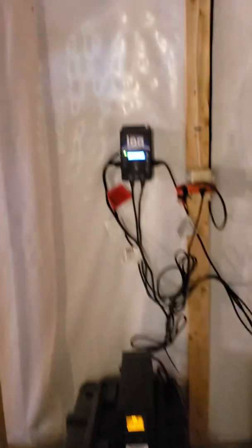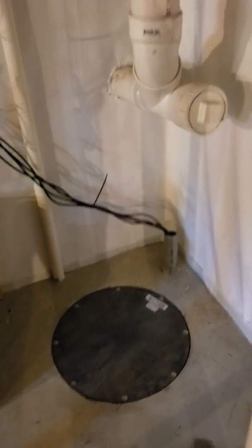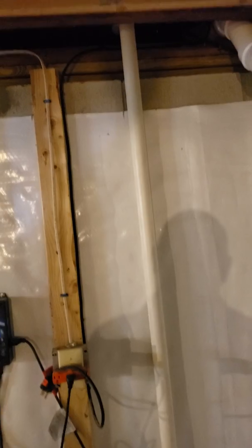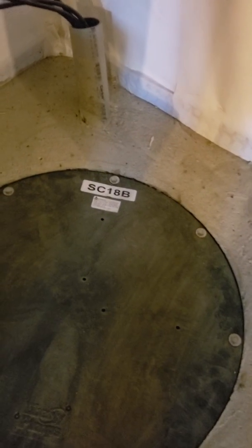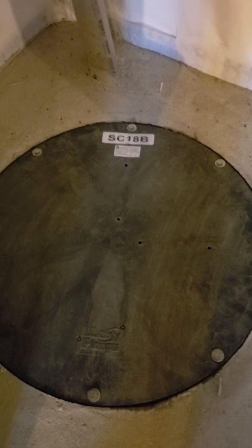I've got two power plus batteries with an inverter box with two pumps. I have my cords coming through that inch and a half PVC conduit, and then I have my discharge line that feeds outside. I'm going to manually set this off so that you can hear how quiet it is. And you'll be able to hear just how quiet this sump is. So that's pumping — it just cycled and emptied the basin.